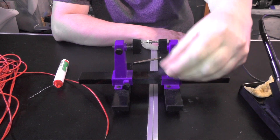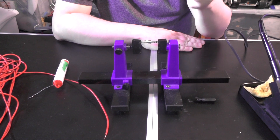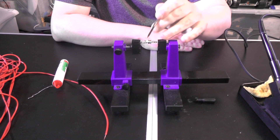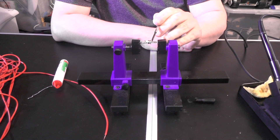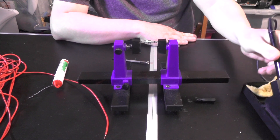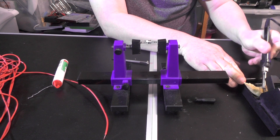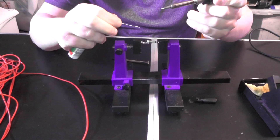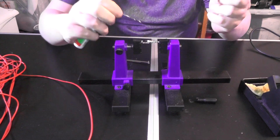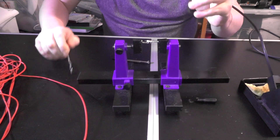Okay, so the iron's warmed up. I've taken the black plastic part off and the jack plug is placed in the helping hands. Now there are three points on this jack plug: the one facing towards me is for the tip, the one facing towards you is the middle bit, and the bottom part is the ground. We want to solder to the tip, so I'm going to solder to the part nearest me. First of all, we're going to clean the iron up.